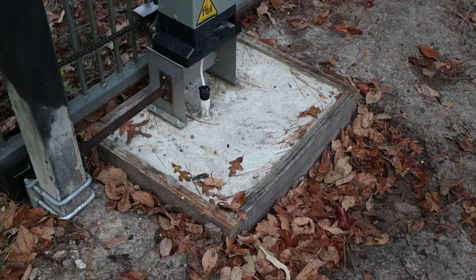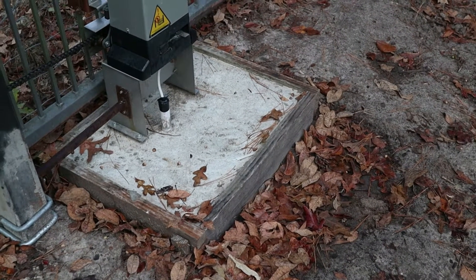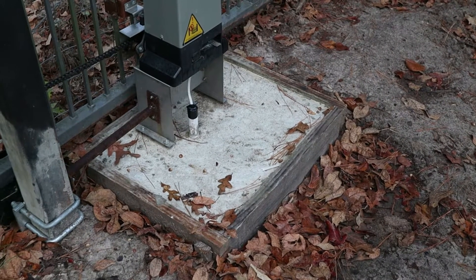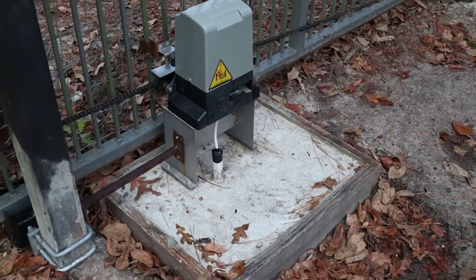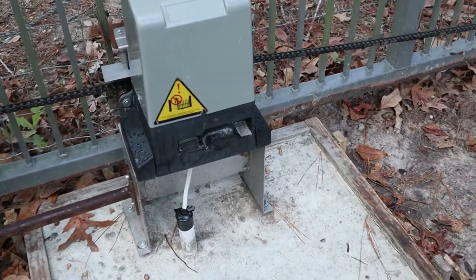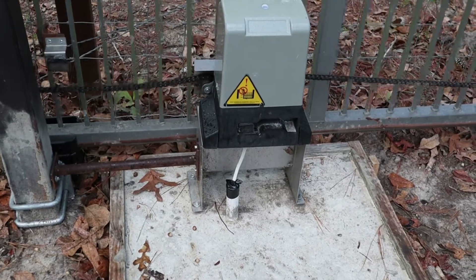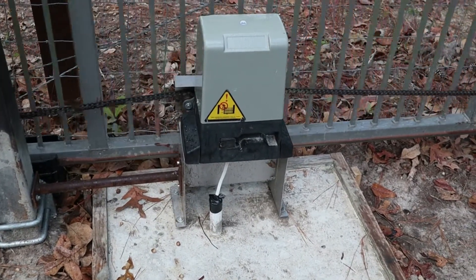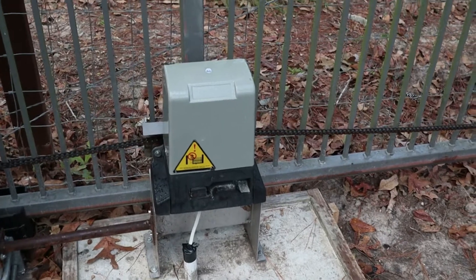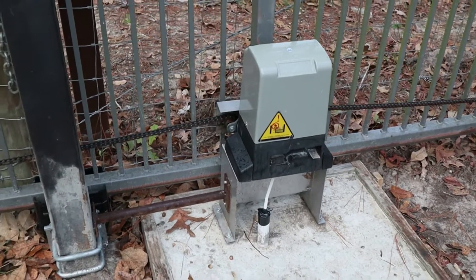The pad you see here — I've still got the wood around it that I have to take off and then fill in with dirt. This pad is 28 by 24 inches and it's right at 18 inches deep. The motor doesn't shake at all now. You can see I also reinforced it from the four by four over to the motor stand itself. I'm going to close it — you can see there's no movement in the base, though there's still a little bit of shakiness in the motor up on the very top; that's just cheap steel from China. But the base is not going to shift around, which would throw the sensors out of whack and cause the gate not to function properly, and that's what I was running into.